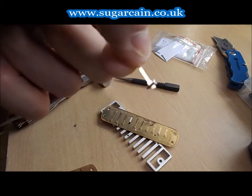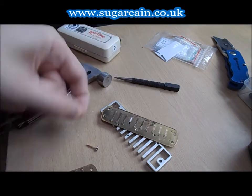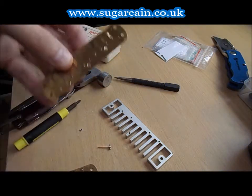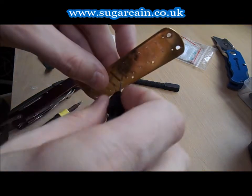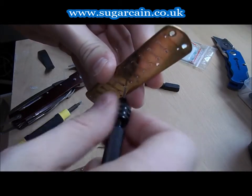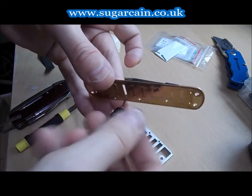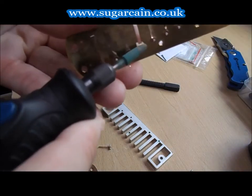I've just installed my little screw — these are 1.2 screws, really fiddly to keep hold of — and a 1.4 screw bolt. This is my method and it's guaranteed to last a long time. As you can see it won't go through the hole yet because it needs tapping, so I tap my holes with a 1.4 tap. I put a little bit of grease on the tip and I don't use much because I'm only going through about one-point-something millimetres of metal. Once I've tapped it and it's come through the other side — boom, that's the one.